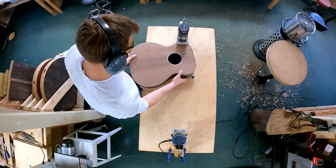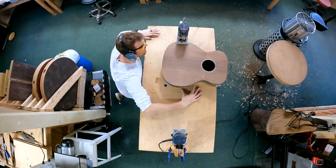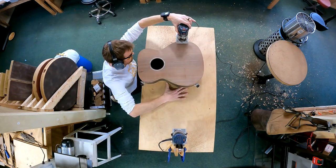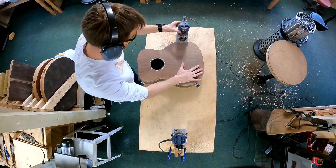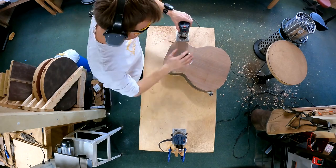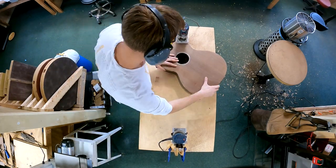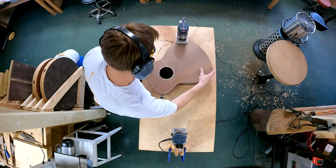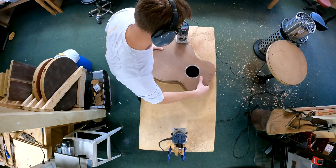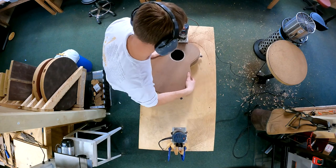Now on to cutting the channels. Grain direction is very important here, and I start by doing my conventional cuts first. The conventional cuts are only in the areas where the rotation of the bit doesn't allow the bit to bite into and get under the grain and tear out a chunk. Once I've cleaned up those particular areas, then I can go in the climb cutting direction around the rest of the guitar. So that cut I just made was for the purfling ledge.